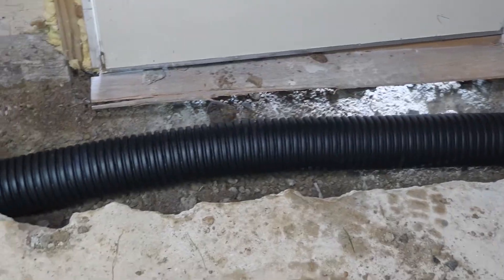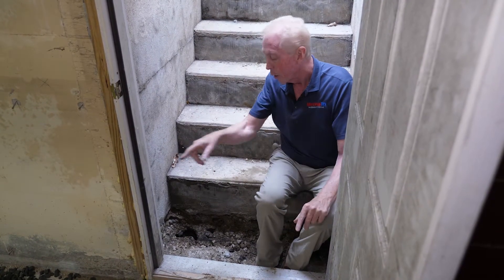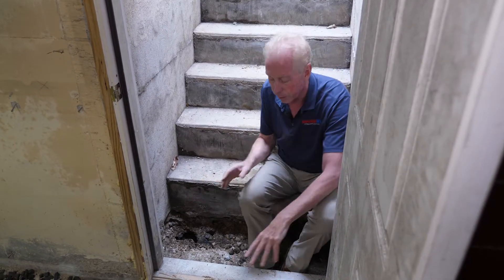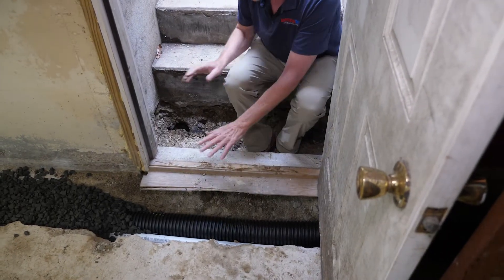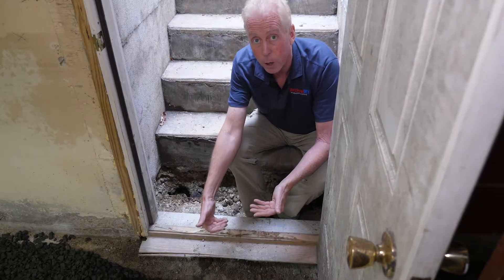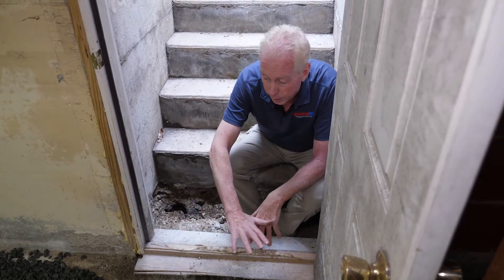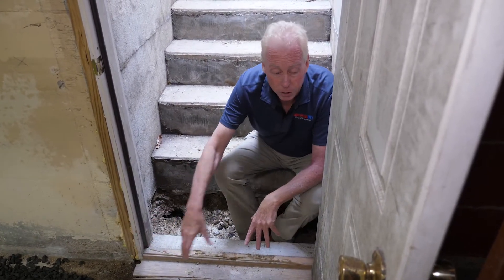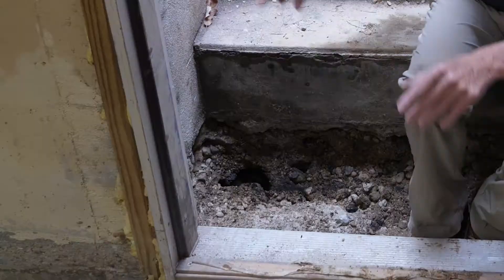This is a main area of concern. Now that we've removed all this, we're going to get enough drainage in here. The key is that our drainage is going to be down significantly lower — draining way below the bottom of the floor. No water is going to come in any contact with the actual main body of the floor. We have a pitch on this going around to our sump pump, and the water's pumped up and out away from the house.